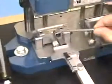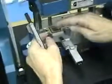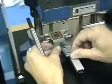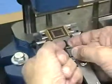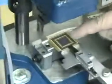The last step is to form the leads on each side to complete the footprint. The proper insert has been mounted into the tool that will produce a shoulder dimension of 51 thousandths with a radius of 10 thousandths. We've adjusted the standoff micrometer to 105 thousandths to achieve a standoff height of 10 thousandths, and then adjusted the backstop to fit the body of the part. We then carefully position the hold-down spring over the trailing edge of the part. Now we're ready to complete the process by forming the leads one side at a time.